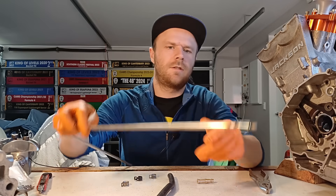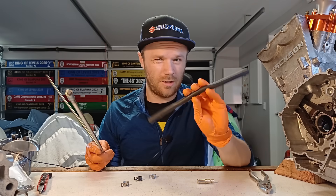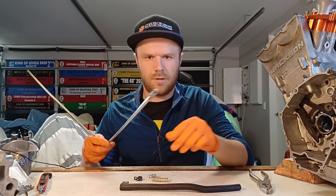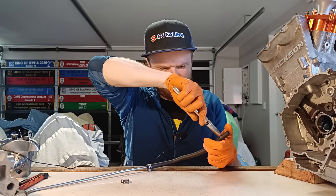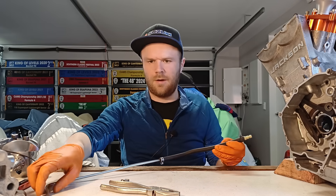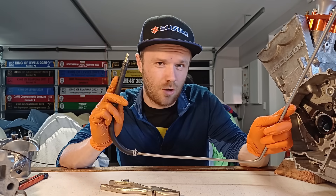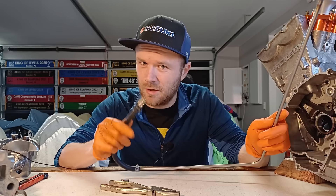And there we are — I have all the pieces to the puzzle. I have the degassing lance, the hose — this is just some brake hose off an FXR150 — and then I have a quick connect fitting to plug the argon into the degassing lance. A degassing lance with a removable stainless filter. The kiln's just got up to temperature now, so I've got to leave it there for at least three hours because I do not want the inside to be cold.